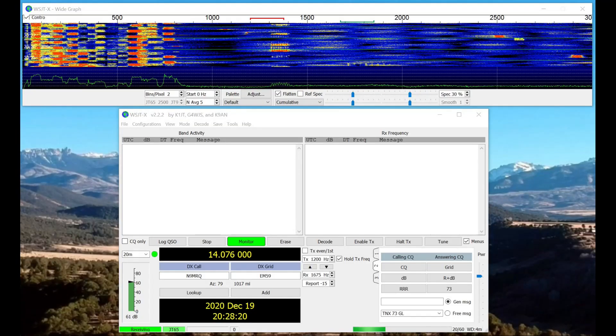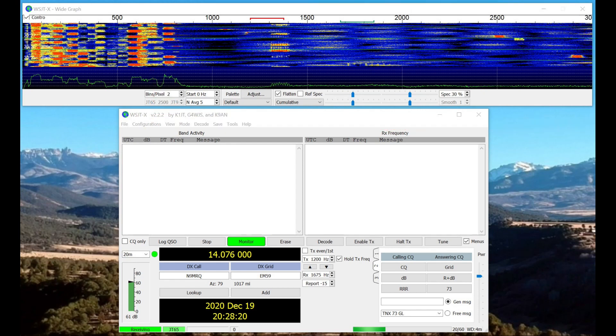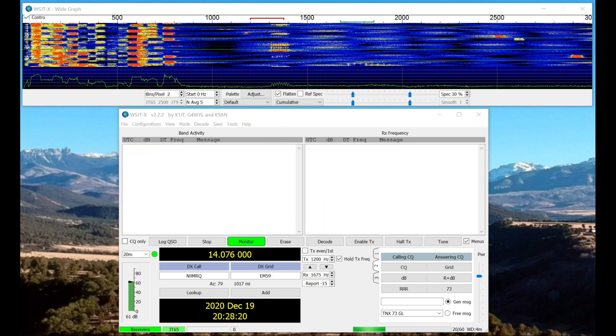We'll look at a couple pictures here. This first picture shows WSJTX set to JT65. You'll notice down here at the bottom that 14.076 is the frequency it's tuned to, and the band goes from there up to 14.079. From about the 800 hertz mark on up, there really aren't any signals. Look at the little red bracket at the top in the middle — that's how wide the signal would be. There are some stray signals in there, but none of them are JT65. And look what I've got in my band activity box: nothing. That's because there's nothing wrong with my setup or my WSJTX.